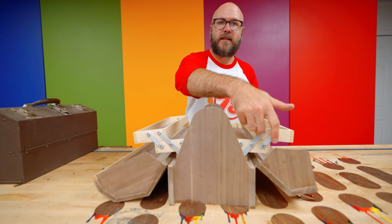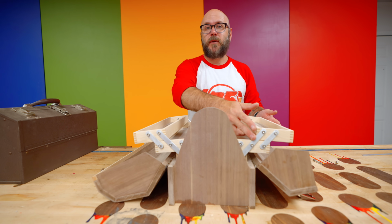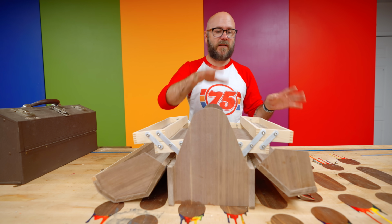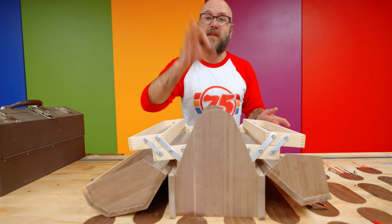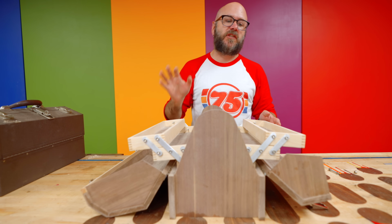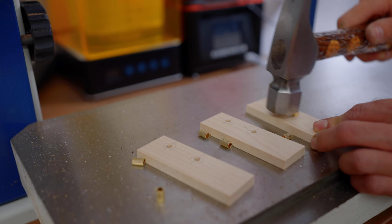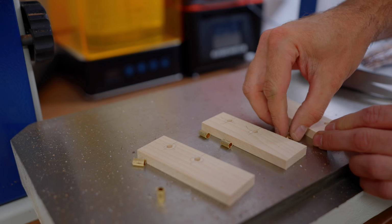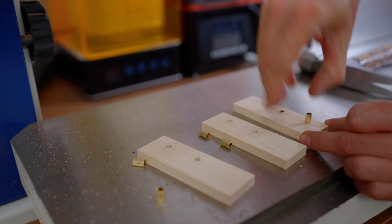All the hinge mechanism parts, that's just cut out of aluminum. I like working with aluminum because you can use woodworking tools on aluminum, it cuts and drills really easy. One of the other things that the guys at KenCraft suggested, on these thin walled drawers, is to reinforce the holes that I drilled in there. So I just found some brass tubing and cut that off and shoved that in there.